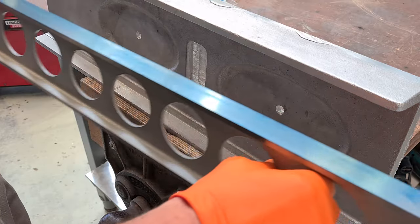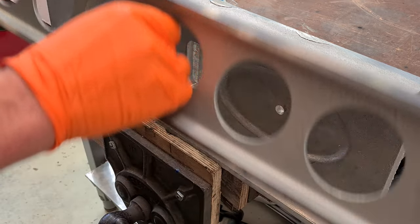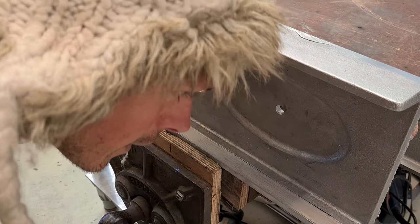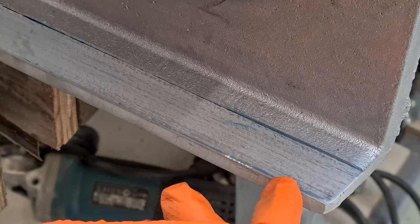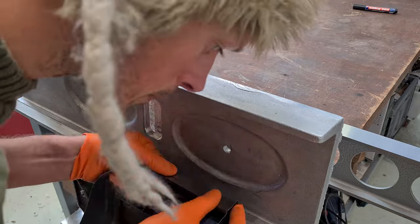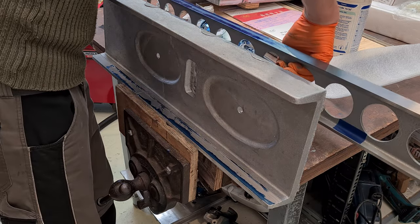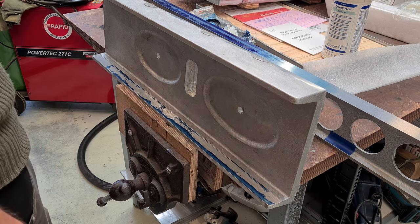While I think I understand the principle of this method of straightening — using a straight edge and blue to rub off — I have such little practical experience I'm sure there's plenty of people shouting at the screen right now. This area here seemed to be quite contacty so we'll just have a go at getting rid of that bit and down the other end. I think just a few spots on the inside is stopping it contacting a lot.